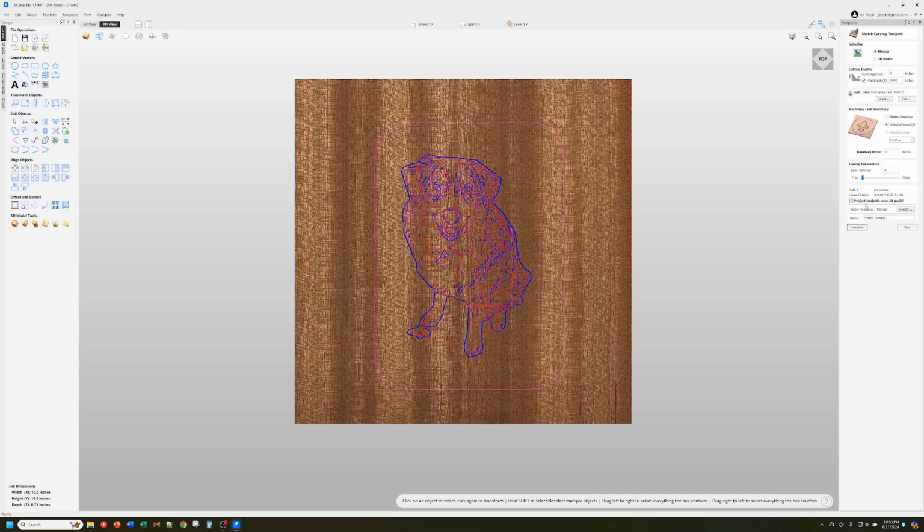oh yeah, you can. That's a cool thing too, you can actually do this sketch on top of a 3D model if you want to. So that is an option I forgot to mention. If I were actually doing that on a 3D model, I would need to pick the one with Z here, because that would allow Vectric to output Z movements as well. Or I shouldn't say allow Vectric. Vectric's going to output them, but the post processor wouldn't put them into the G-code.